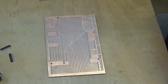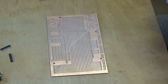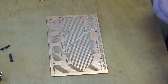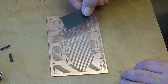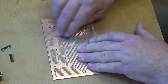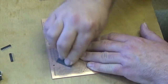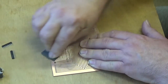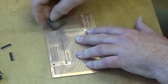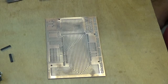Before we solder anything, this printed circuit board is just copper on one side and it oxidises whenever it's in the air. As with any soldering operation it works best if the surfaces are nice and clean. I've got a very fine piece of emery paper — wet and dry — and I'm just going to fold that in half and give it a little rub over where we're going to be soldering, over all the holes in the board. That's coming up all nice and shiny now, which is going to make it much easier to solder.